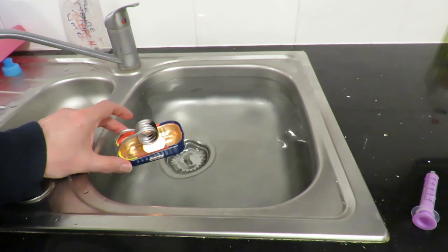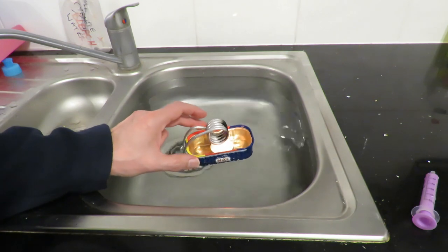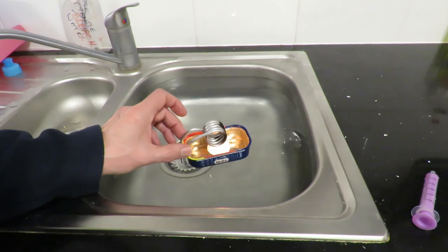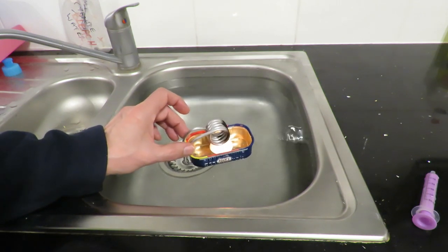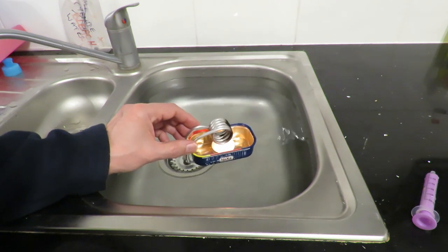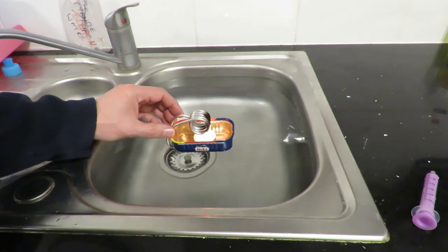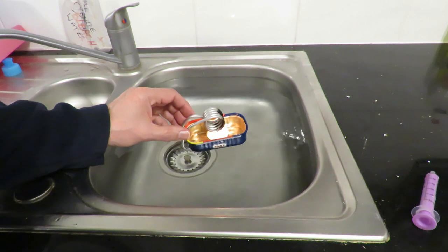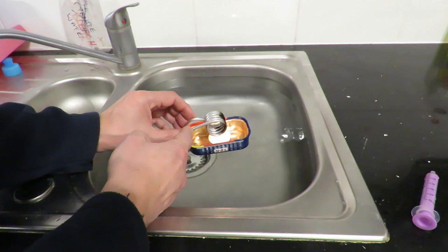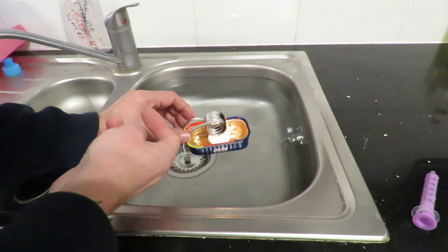Before I do stop, I do get quite a few questions on the ones where I've used hot glue and epoxy resin to seal the pipes. Well, there you go. Those pipes aren't hot. Well, they're slightly warm, but I can assure you I'm not burning my fingers at all. And that's still pumping away there. Because that's the whole point. When the steam gets out here, it condenses straight away because it's cold. And it turns back to water, and the pressure pushes the cold water back in.